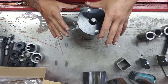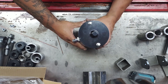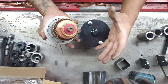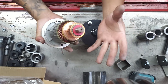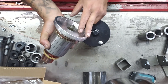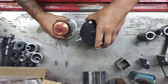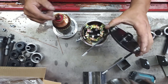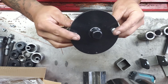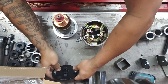I always keep these square nuts aside — if you ever have to transport a motor you can use the same nuts; they fit best. So what the customer did was when he was trying to replace the bearing end cap, he lifted the motor up and the whole thing fell apart — you can see it falls apart right there. That's why I always say in my videos on motors: cradle it from the bottom so it doesn't fall — hold it like a baby. Now the armature and bottom cap are out, and you can see everything spinning freely. This is a brand new motor, never been run.